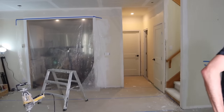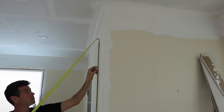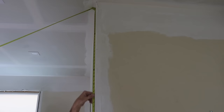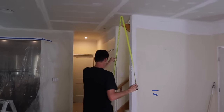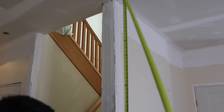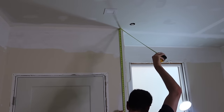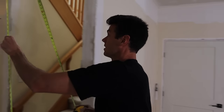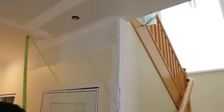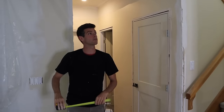First thing I need to see what the height is for all of these corner beads because I have a bunch and it's maybe not a standard height. So I got like 106 and we can go a half inch down — 105 and a half. Let's check the other spots. Yeah, 105 and a half would do there and about here. A little short there but there's baseboards going in so 105 and a half is the first measurement.